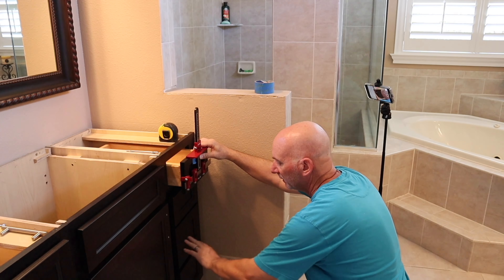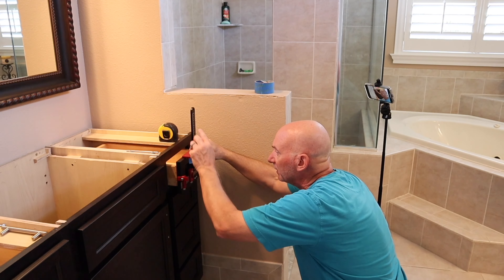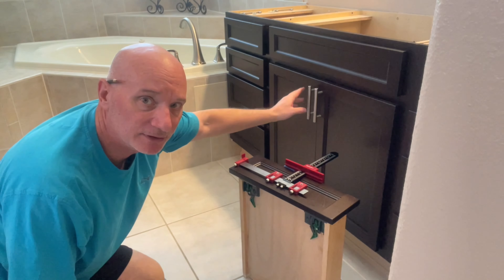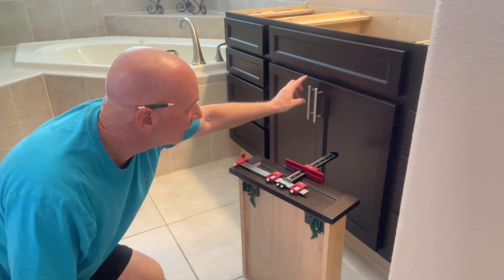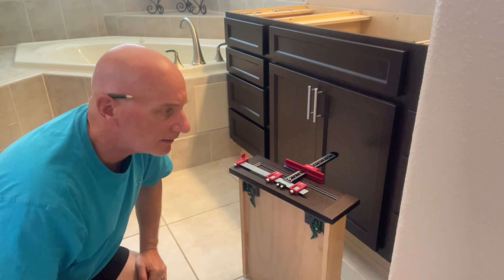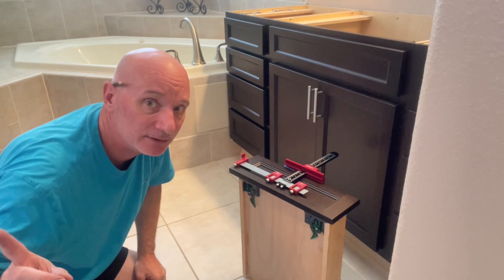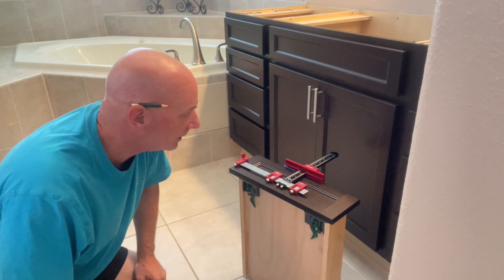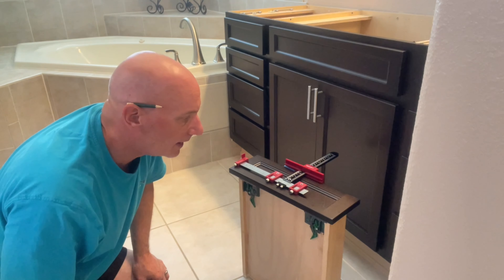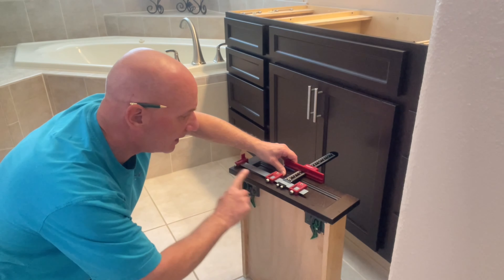I make sure this is along the side nice and tight so it's exactly perfectly positioned. I start with the normal size drill bit, take it out, put the smaller bit in, drill it, then put the other side in and do it again. The problem is I'm drilling through two pieces of material — three-quarters inch on the face frame and three-quarters inch on the box, because this is dovetail joinery and the boxes are solid three-quarter inch. I had to get extra-long screws for the hardware because the screws that came with the drawer pulls were not long enough.